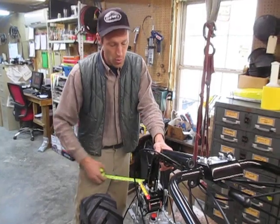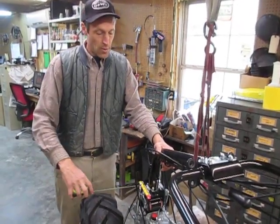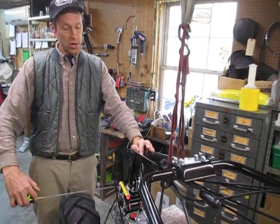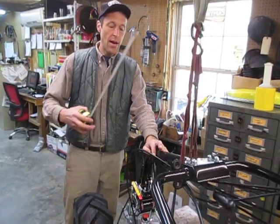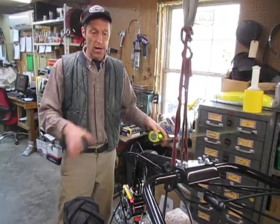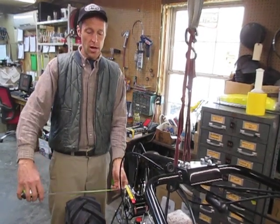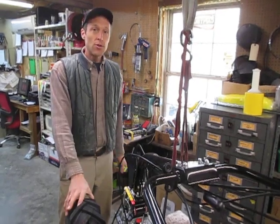That's actually perfect for running a rotary plow, which is how we're going to set these wheels up on this tractor. Of course, you can do your outside track width as well, so you know how much space the tractor needs to get through. But that's the easy way to do it — if you're playing with adjustments on the wheels and trying to get it right for your application, you don't have to do both wheels and then measure. Just do one, kind of slap it together, take a center measurement, double it, there you go. That concludes this segment. Thanks.